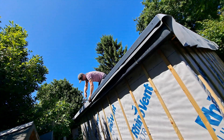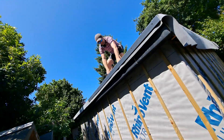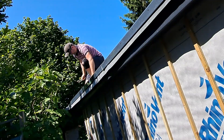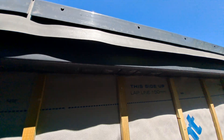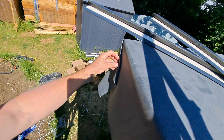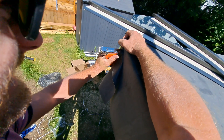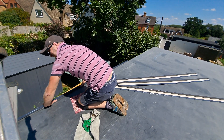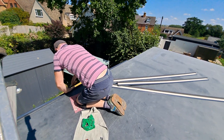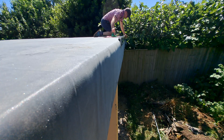The last bits of the trim - absolutely no issues with this bit. There's a big thick foam lining to these and it's stated that you need to squash it around 70% - I just leant on it and then nailed it and figured that would be enough compression to stop the water coming through. Follow it all the way around, and where you put the trim on just put a bit of super glue on - only stick it to one part of the two pieces you're joining - and leave a gap for expansion on the plastic. Corners I just folded like you would any other roofing material and a couple of staples held them in place. Everything just gets covered by the trim pieces anyway, so don't try for perfection on these bits.